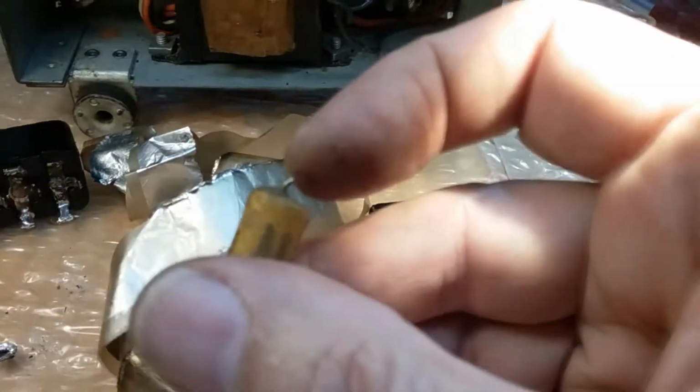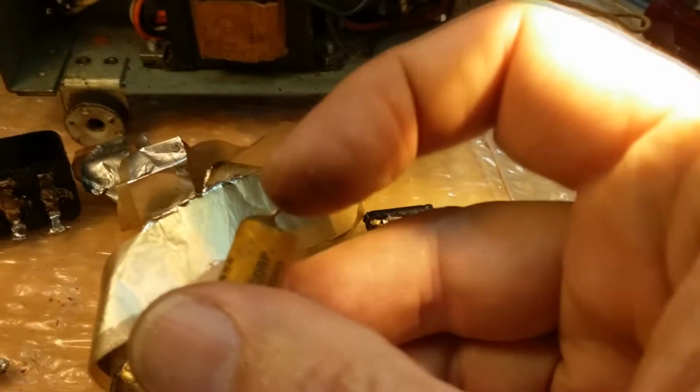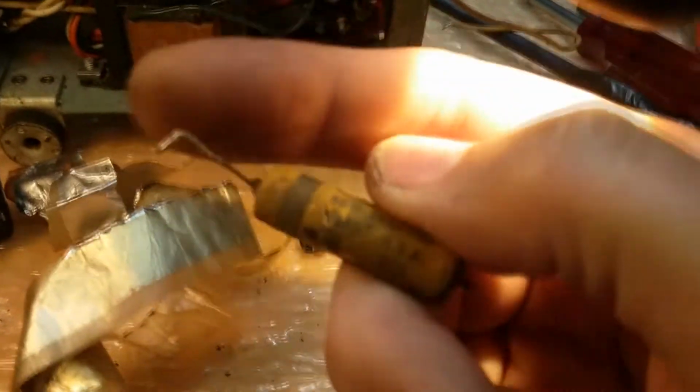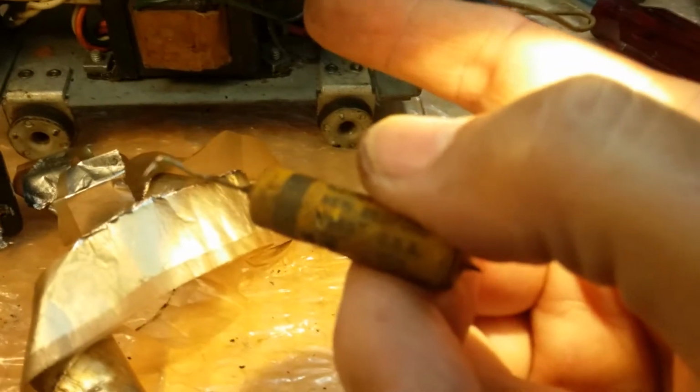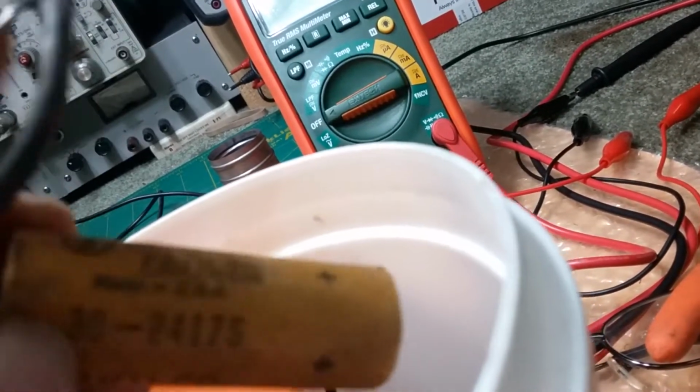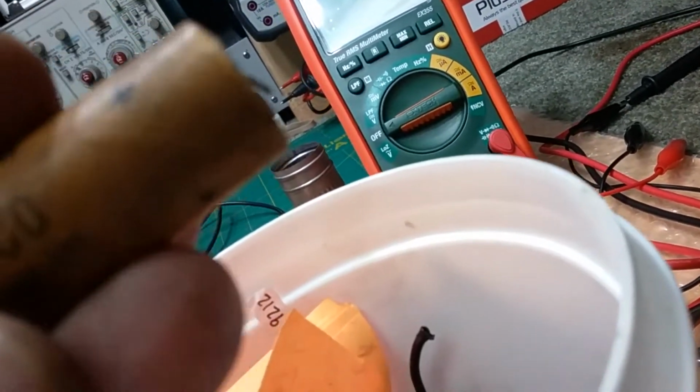So I had to wedge in to cut this one out because it was short, because you don't want this acting like an antenna. This, you do. You want this to suck all the signal, all the noise, and throw it to ground so that it doesn't get amplified from the positive side. Well, now you know what's in the capacitor. You get to see it. And that's what's in these. That's what's in all of these. That's what's in here. It's what's in every one of them, even these electrolytics, this dry electrolytic.